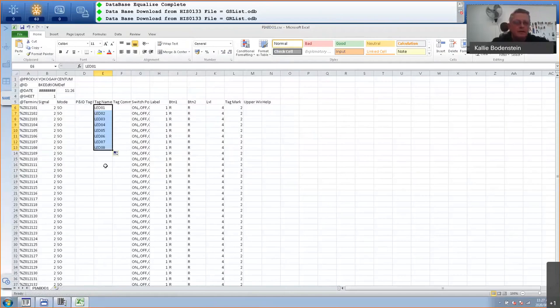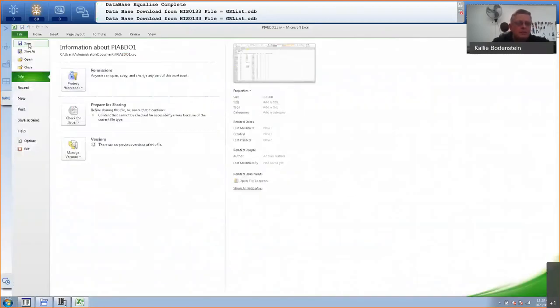And then I also have some control signals on channel number 11, which is this one here. I have my feedback or my control to pump 1. So this will be pump 1 control. And then on channel 14, this one here, I've got pump 2 control. And on this channel 15, I've got valve 2 control. So now I've specified the control signals to my pumps and valves. I've specified the feedback signals. I'll just go here and save this. I'm happy to save this. Yes.